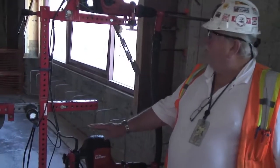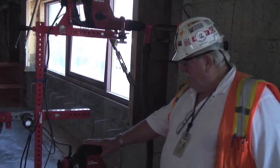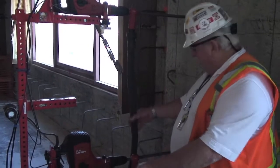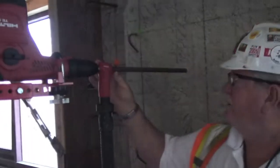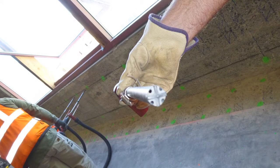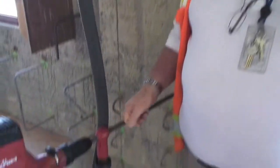This system starts off with two TE50 Hilti drills. They have a Hilti vacuum with a hose and an apparatus right here that actually surrounds the bit. This bit is hollow, and if you looked at the end of the bit, you would see holes where, when it's crushing the concrete, it's sucking the material down the bit, in through the hose, to the vacuum, so that there's no silica dust exposed at all.